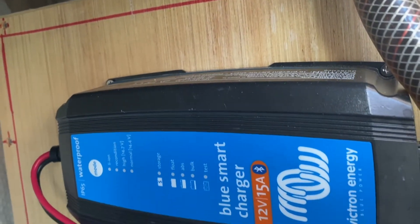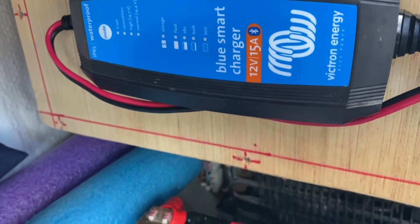These devices are recommended when you have different battery chemistries between your start bank and your house bank, as we do. Typically the alternators that come on engines are dumb and just put out a constant voltage, which doesn't always get your house bank completely topped up. The last charging item is a 15-amp battery charger connected to the house banks. Since we don't have a shore power connection, if we go to a marina we use an extension cord that plugs into the power post and directly into the battery charger. That's the charging side: solar, battery charger, and the engine.